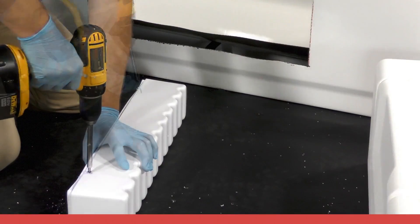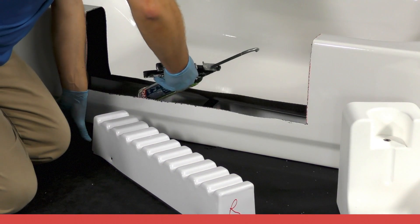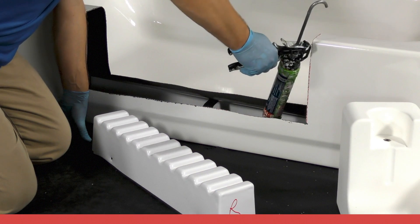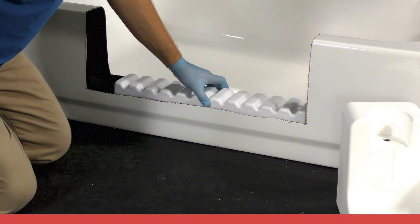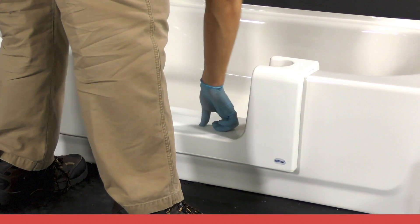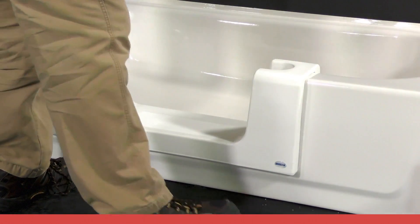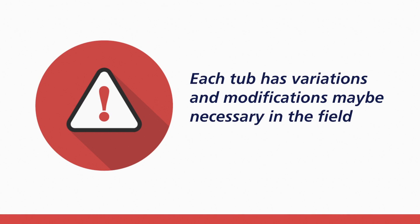Apply adhesive around the perimeter of the large box. Compress the small and large support box structures back together to the appropriate markings made earlier on the small box. Place the support structure back into the channel and insert the CleanCut product to verify that proper placement has been achieved. Secure both sides of the support structure by placing two screws in each side. Apply adhesive to the tops of the 2x4s already in place in the channel if needed for height adjustment, then insert the support box structure. Place the CleanCut product into position once more to inspect fit — this is the final opportunity to make any adjustments. For fiberglass and other types of tubs, it may be necessary to adjust the installation of the support boxes based on the framing or support material present.